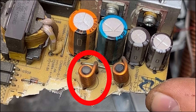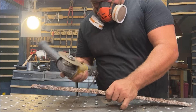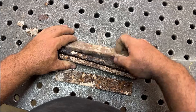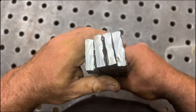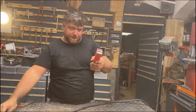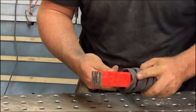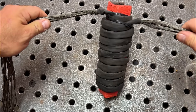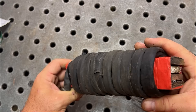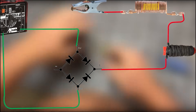I end up with about four meters of thick copper cable. What I am building replicates a small component — a copper coil twisted around a ferrite core. I do not have ferrite, but I have large pieces of steel, which are just cheap iron. It is rusty on the outside but smooth and in good condition in the middle. I wrap the iron core in paper tape to isolate it, then twist the copper cable around it twice and cut it. The calculation for the number of turns gives precisely this result. To connect everything to the welding machine: take the positive lead from the bridge rectifier output, pass it through the coil we just made, through the snubber coil, and finally to ground.